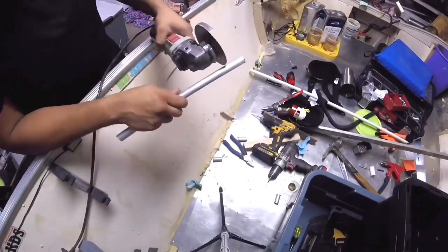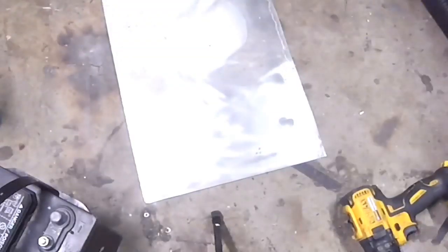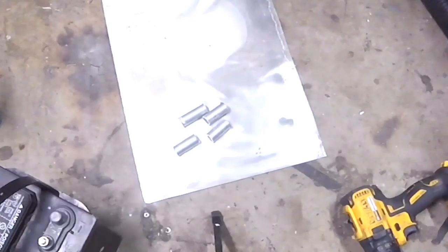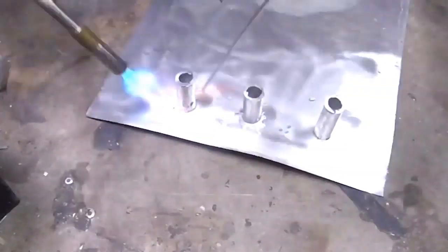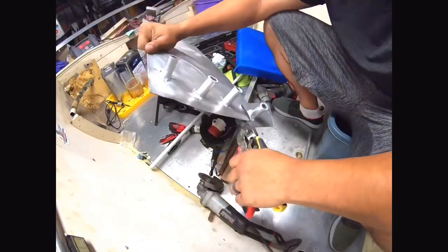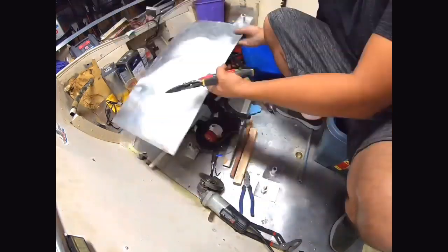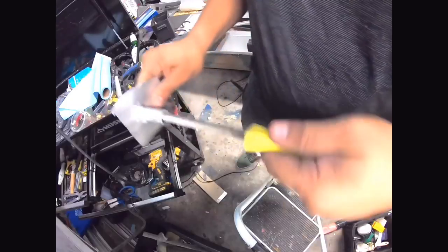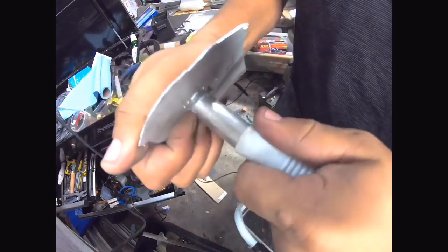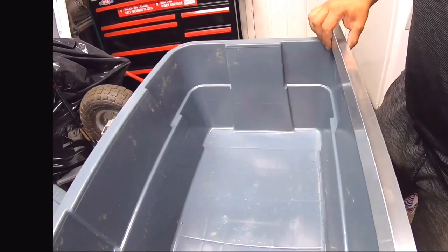To do that is going to change the whole thing dramatically — we're going to have to make the dry hatch bulletproof. Normally I just run it in sections with four large gaps in each corner to offset water flow into the hatch, which works really well. I haven't done anything like this since my 16-foot Jon boat, but because of how we're going to pour the foam and lay everything in, we have to run tubes through the foam into the bottom of the subfloor. To do that we're brazing — this is 3/4 by 1/16 inch aluminum tubing onto a piece of aluminum sheet metal. We gave it pretty generous brazing. This works really well to offset dry hatches; it's not welding, but for simple applications with no load-bearing structure it works fantastic at bonding — way better than any epoxy. But before we can apply those we have to make the dry hatch lip.